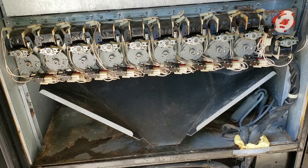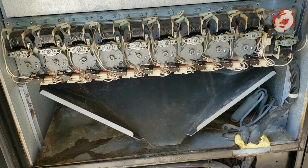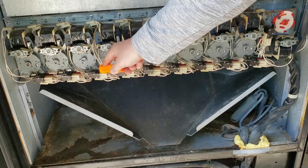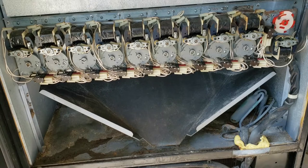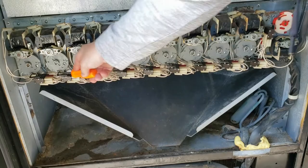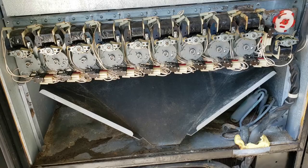Number five: dirty, both fall into the channel. Number six: dirty, both fall into the channel. Number seven had a nice clean stop, so that one's probably fine — I'll clean it anyway. Number eight doesn't do anything; I don't hear a buzzing and the top motor doesn't spin, so this thing has probably got an electrical problem. Number nine: top motor spins, bottom cam doesn't move at all, so probably another gear issue. Number ten: nice clean stop. So we run the gamut on this one — dirty, gears, electrical problem.